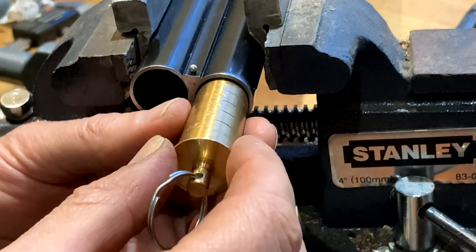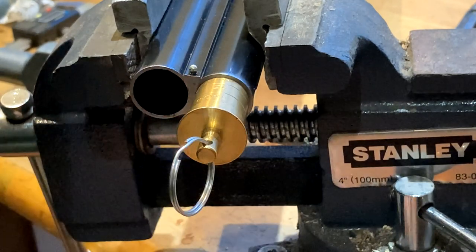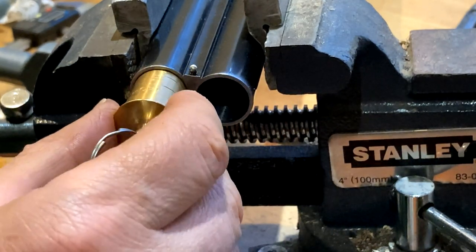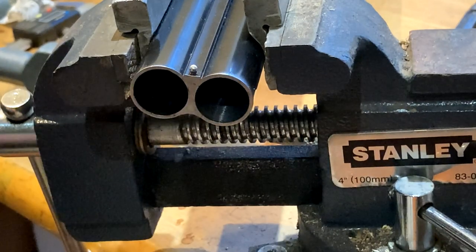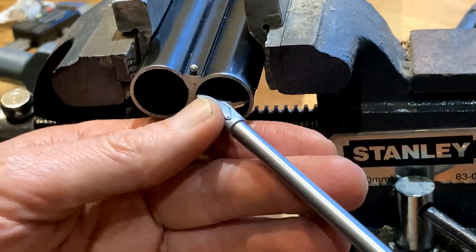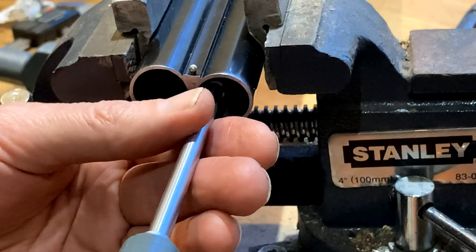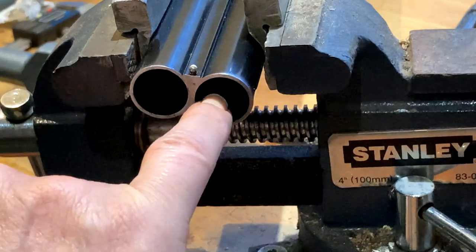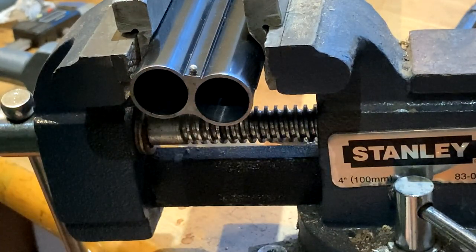So at this point, if you were measuring with a Bisley choke, that would now read quarter. So that would be quarter and quarter now. But using a more accurate dial bore gauge, it's still actually got another 5 thou to go yet. So continue. And we've got to do it 4 times. So this is only the first time, and then we've got to polish them as well.